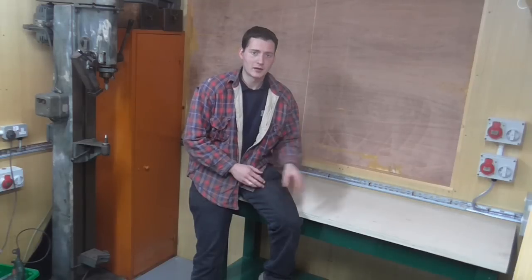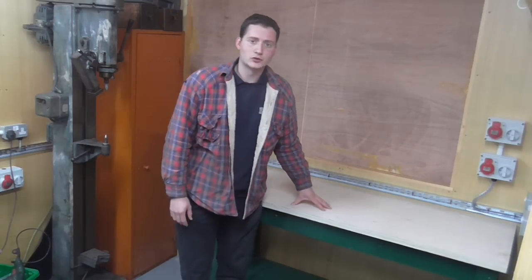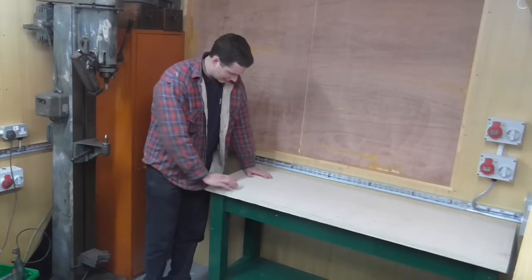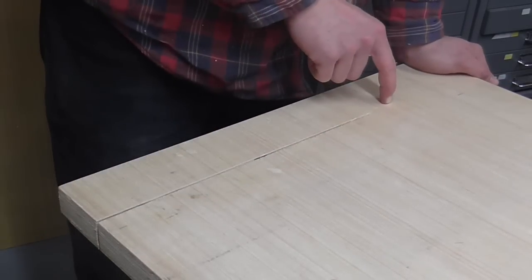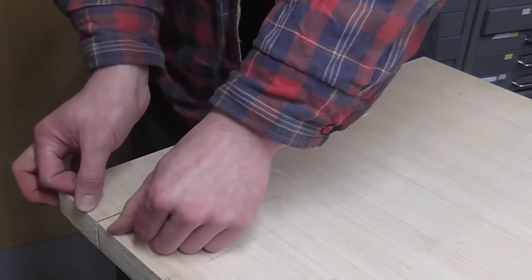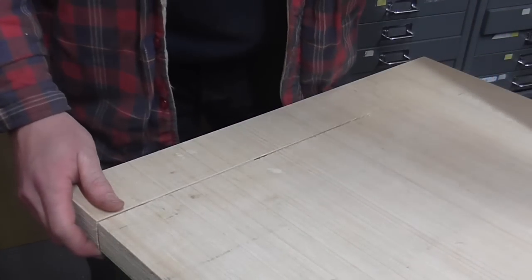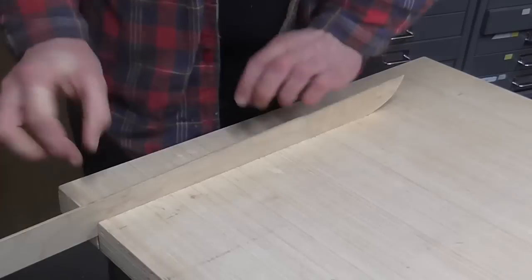Now for some work benches — this is a work bench that I built while I was at school and I had it in my previous workshop. Since then I've added a shelf down below and painted it green. I've also made a plywood top by gluing two sheets together and screwing it from underneath. However, while cutting it to length I had a little mishap with my circular saw and I've actually sawn over halfway across the top of the bench. It's positioned directly above the cross piece that runs underneath so I haven't lost too much strength, and I'm going to glue a thin piece of wood, tap it in, and put some screws through here to fix it.